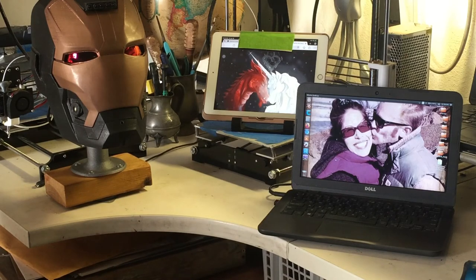And then I've also run a program on the board, which I will link down below in the description, that goes ahead and activates the camera as soon as the device boots up and broadcasts what the camera is seeing, as well as some limited controls for the camera to start recording in different ways, video, time-lapse, photos, whatever you like, and some setting adjustments that you can access over a browser so that you don't need to actually VNC in order to control the camera. You can do so from your phone or from your tablet. So I'll show you those things here.